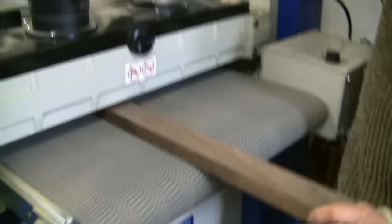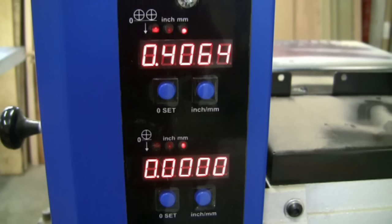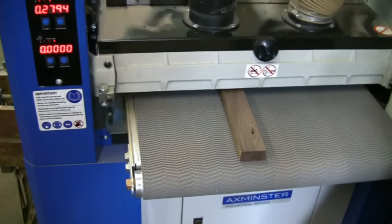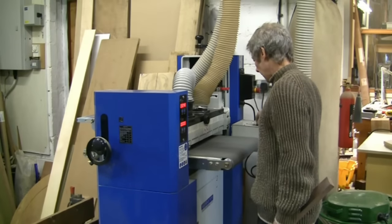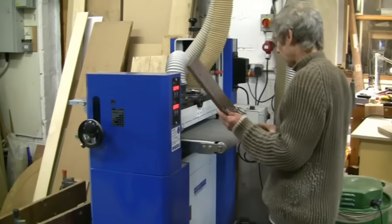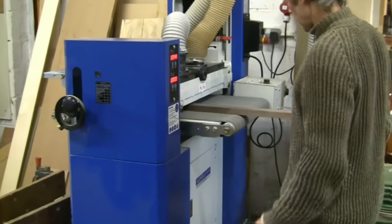I've visited factories in Scandinavia and they're almost like hotels — there's hardly a speck of dust anywhere. It's important to establish how much material you're actually trying to take off in any pass, and by adjusting the handwheel and looking at the digital readout it's possible to take a very fine cut. Far better to do several light passes than one heavy one, which can cause the wood to scorch and certainly reduces the life of the abrasive paper.